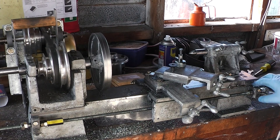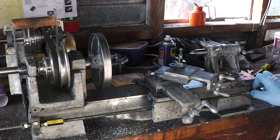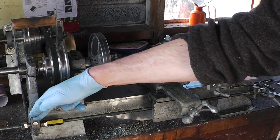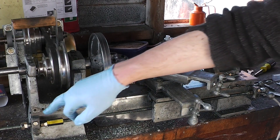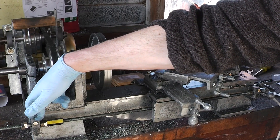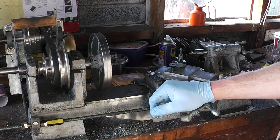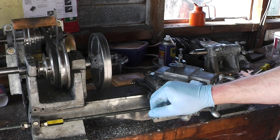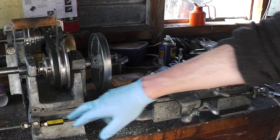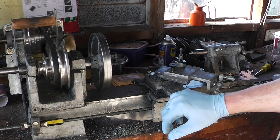After that the next part was the lead screw, along with the lead screw journal bearings. These bearings are the first part you'll cast on a steel mandrel to make a bore. I tried using India ink around it, on the basis that India ink has a lot of soot in it — unfortunately it also has lacquer, which seems to have off-gassed on one of them. I was able to fill that with metal epoxy, and it's a low enough load that turns slowly enough it's not a problem, but I tried it again later on and ran into issues.